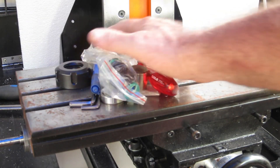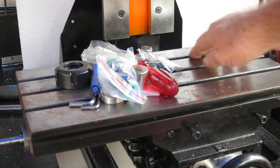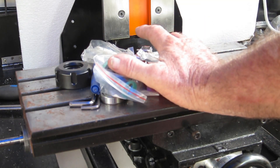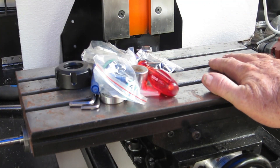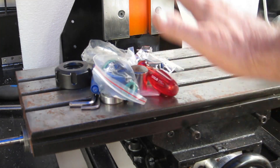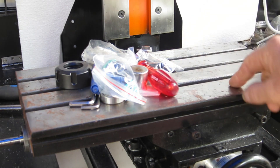The table's covered in crap from where I've been working on it. I think one of these spots sits a little higher than everything else but I need to bolt a vice to it so I can make a fly cutter to cut the whole table with. Before I do that I might get out the face mill and just mill a section in the centre so I've got a completely flat area to bolt the vice to. Those are the things I've got to get done before we start throwing too many chips around, although you'll see a few with the face cutter.